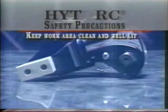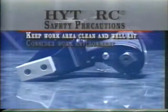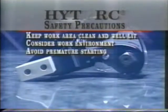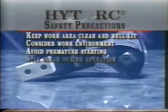Keep your work area clean and well lit. Consider your work environment. Electrical pumps should not be used in any atmosphere which could be considered potentially volatile. If there is any doubt, use an air pump. Avoid premature starting. The pump control is only for the use of the tool operator. Avoid using separate operators for the pump and tool.